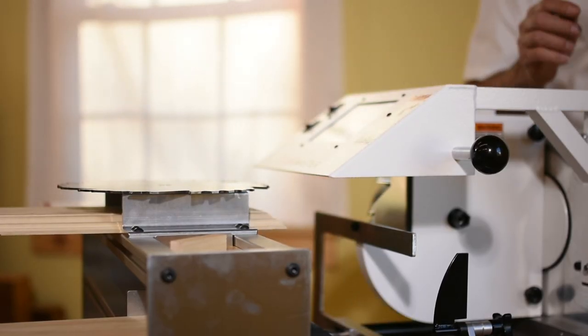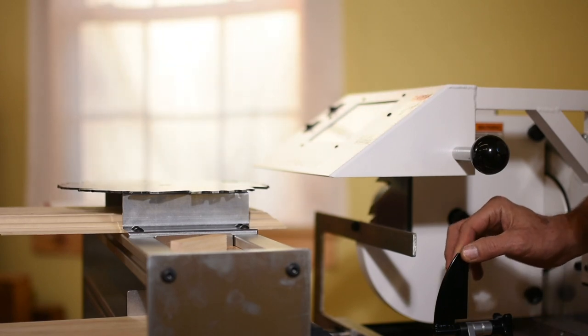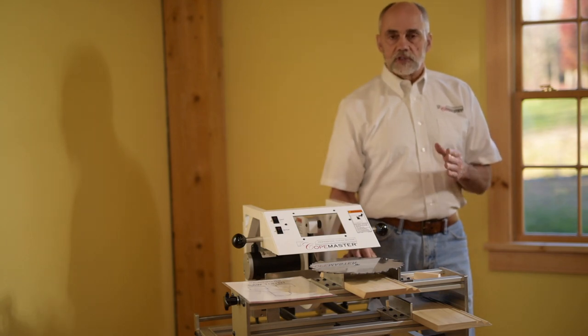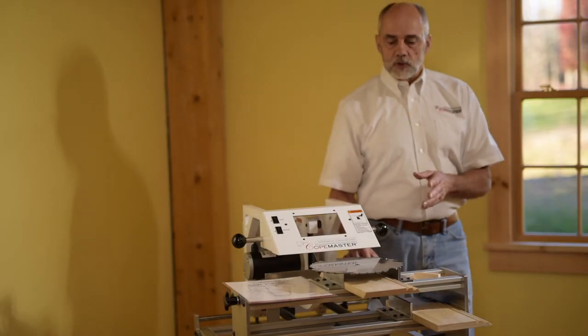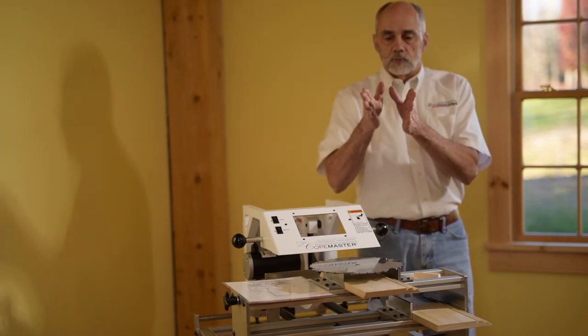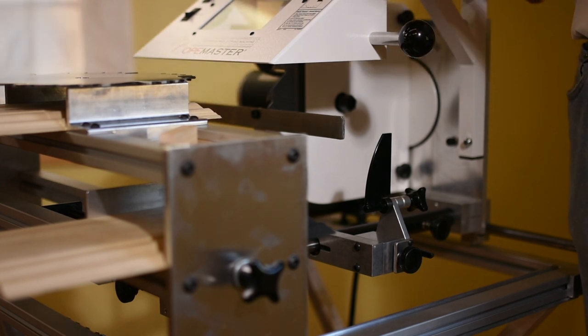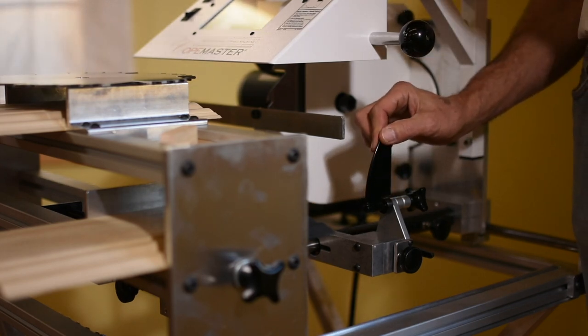The stylus is 120 thousandths thick — the metal we start with is 115 thousandths and powder coating brings it up to about 120. So the stylus is smaller than the saw blade. The reason we made it smaller is that when you sharpen a saw blade, every time you take a face cut the tooth is relieved on the back, so the face gets narrower as you go back down the tooth. After a couple of regrinds, you might be down to 120 thousandths or so, even with runout. That's why the stylus is smaller than the saw blade to start with.